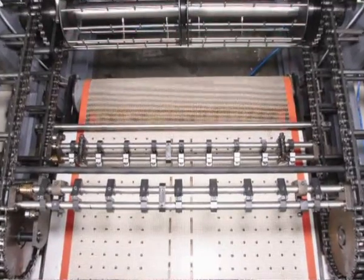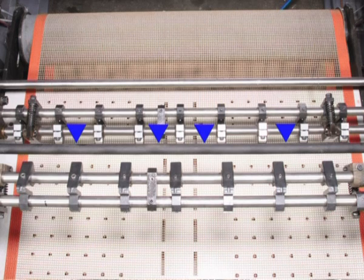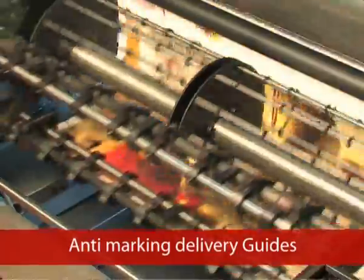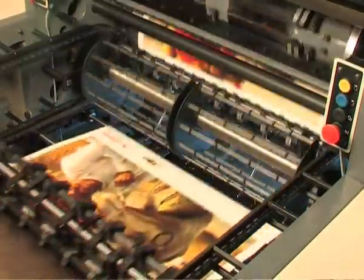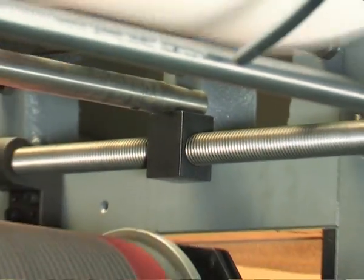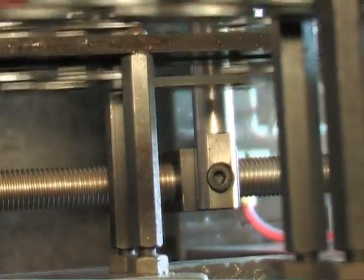The chain delivery system is provided with air blow ejection nozzles for easy separation of paper from the chain gripper to the conveyor of the dryer unit. Anti-Marking Delivery Guides: adjustable guides are provided for smooth travelling of various paper stocks from the coating unit to the dryer unit, and to prevent marks and scratches on the coated surface. An adjustable slowdown shaft is provided near the chain delivery unit for precise delivery of different sizes of paper stocks to the dryer unit.